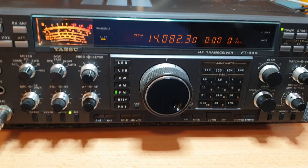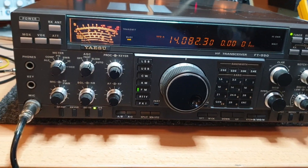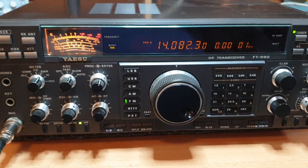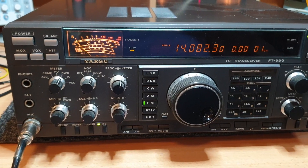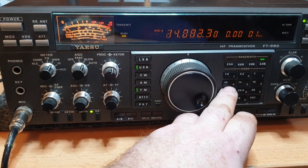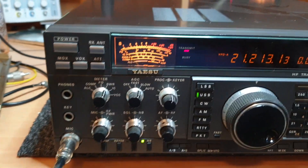Let's try the same trick on 20 meters. I'm asking this radio's tuner — and I've worked on these tuners before, I've got one just over here in pieces, that's an FT990 as well, and that tuner I had to repair. But you know what, they're good when they're working. Let's hit the tune button. Look at that — probably 1.2, 1.3. Not bad. I'm going for a bit of a hat trick here — 1.2, 1.2, 1.2.